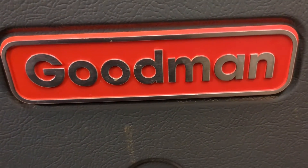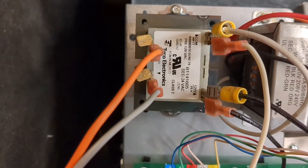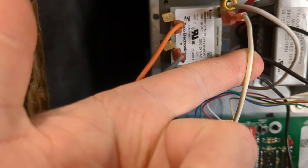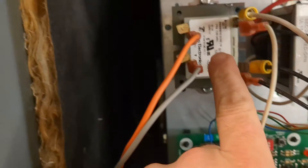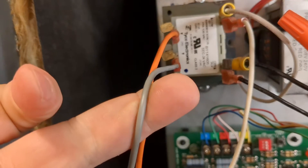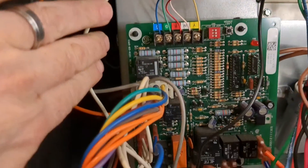If your furnace does have a 120 volt plug-in plugged into the wall, there could be some wiring problems that will need a professional. We'll start with the transformer. A 120 volt transformer in your furnace takes 120 volts down to 24 volts for all the controls — your thermostat and everything the furnace needs. On the top you'll see a white neutral wire coming in, and on the bottom we have a black 120 volt hot. The power goes through that transformer and comes out as 24 volt low voltage, carried down to your control board to redistribute out to your thermostat, safety controls, etc.